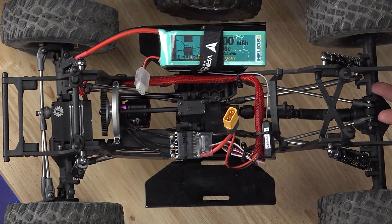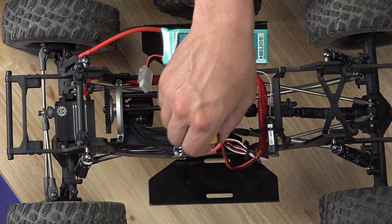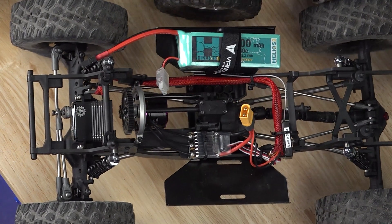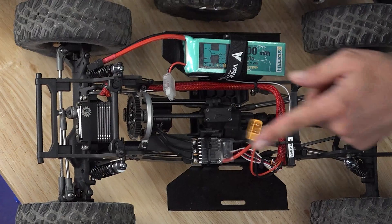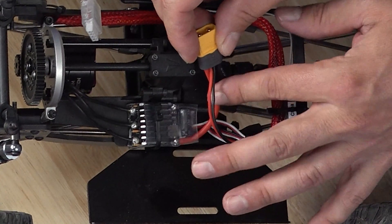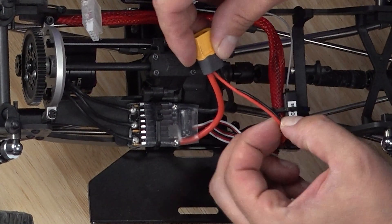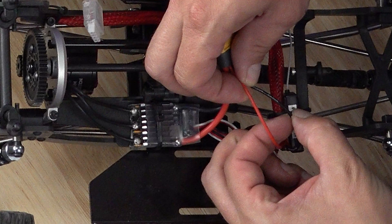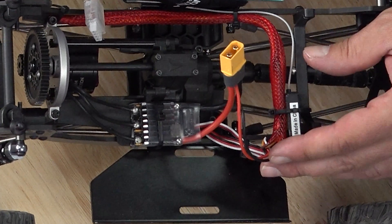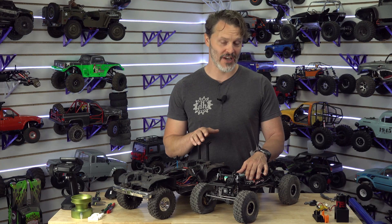That's because these are the stock ones. Could you get away with thinner? Is it getting hot? That's really the question. If it is not getting hot and you want to lose a few grams of weight, then you could try soldering on some smaller wires. These wires are even smaller — these are probably 14 gauge and these are going to be 20, maybe 22. Looking on the jacket: 20 gauge. Why are these smaller? They carry less current, and that's really the crux of everything when it comes down to wire sizes — how much current are they carrying?